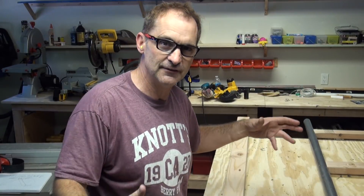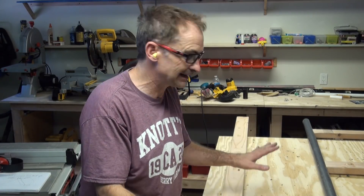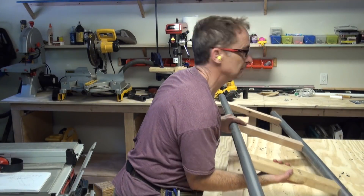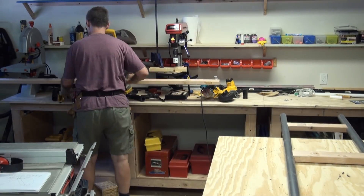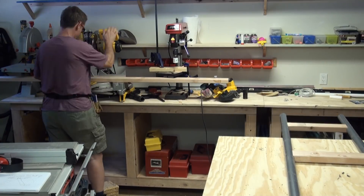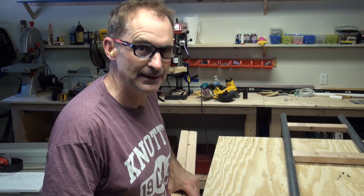I'm going to start out with the base. Depending on where in the yard — if it's on a hill or if it's level — you're going to have different lengths of bases cut at different angles. But again, we're talking dead level here. The goal is to take this piece of track and just put it right up above the bench. I use a base that's 4 feet long — it's really easy because I can just take an 8-foot 2x4 and cut it in half, which I'm going to do right now. JP, when you're using that new chop saw, you just got to be very careful with it. Make sure you know where all 10 fingers are before you start so that you end up with 10 fingers when you're done. I know your dad is going to supervise the heck out of that.